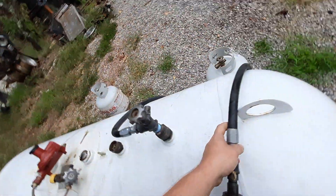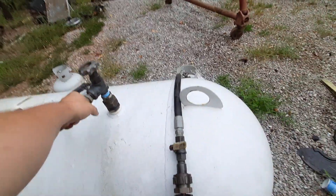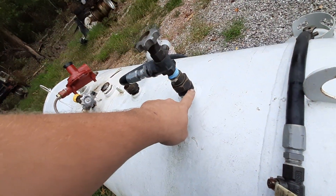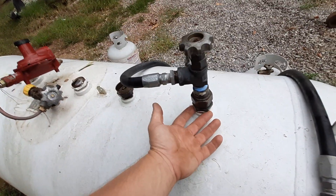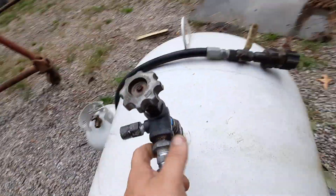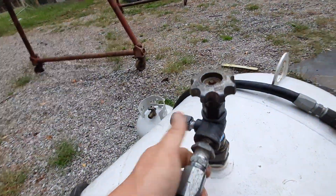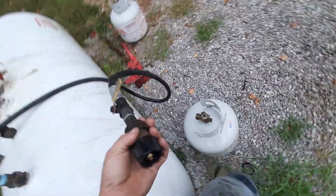This is a filler neck. Most tanks have a second valve over here — it is a liquid propane filler valve or extraction valve. This hose goes all the way down to the bottom of the tank and allows liquid propane to be expelled through the top. You put this tap in there — this is a propane rego blow-off 400 PSI valve. Make sure you use one rated for at least 300 PSI or it will blow up on you. This is hydraulic hose.